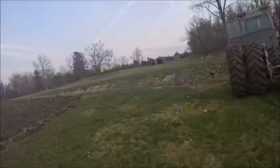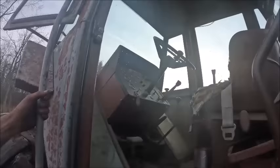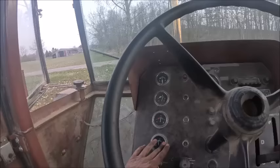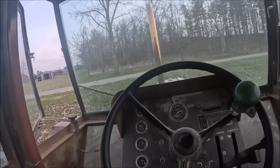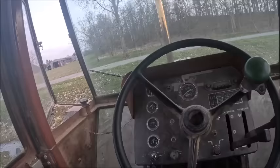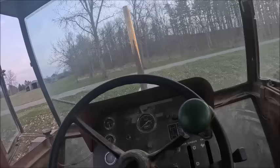But I'm gonna go grab a little bit more fuel. I think I got enough to do what I want to do with my uncle's, but I'm not sure, because that gauge actually doesn't start reading. You can't get the tall sending unit for this tank anymore. They give you a short one for like a regular 55 series tank, so that doesn't come off full until about 3/4 of a tank. So go grab a little bit more just to be safe. Go finish up that front field of my uncle's, and that'll be a day.